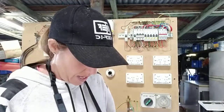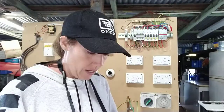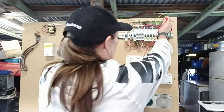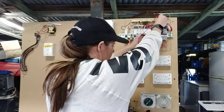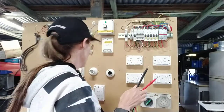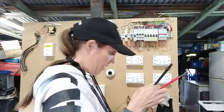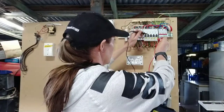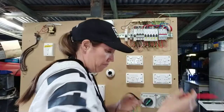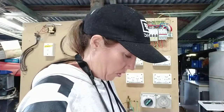So it's a little bit different, but the most complicated thing you'll have is the element. As long as it's greater than 10 kilo ohms — 0.01 mega ohms — you'll be fine. Test your tester, zero it out, making sure that you've calibrated it so it's actually showing zero. And all you're doing is exactly what we did before, but only from earth to your active and neutral. You go from earth, testing A to N, A to N. I've got no movement, but these are my lighting circuits, so I'm going to flick every switch and retest it now. And I've got pretty much no movement in my meter at all — hovering at 200 mega ohms. Zero it out, gone to zero — now I know it's working, no faults there.